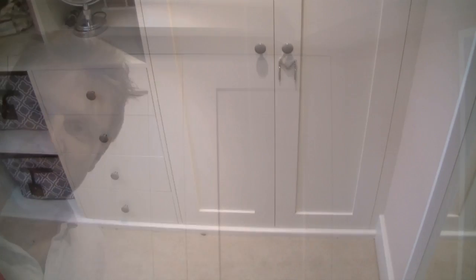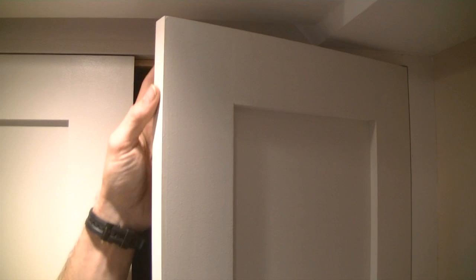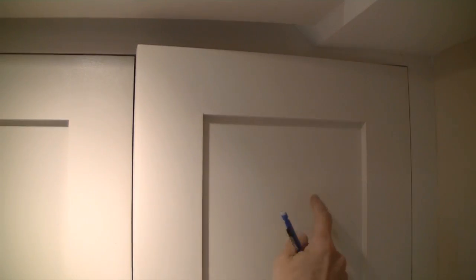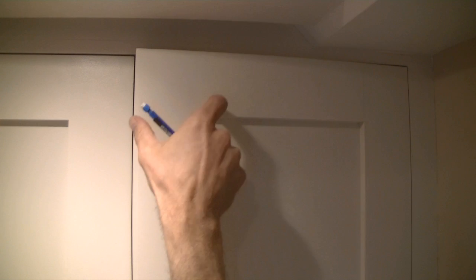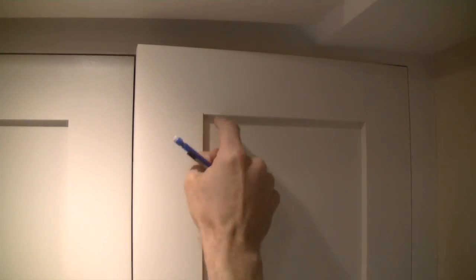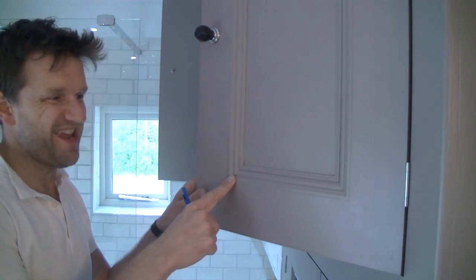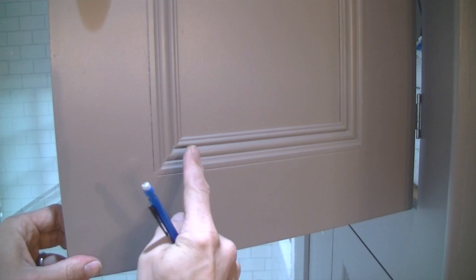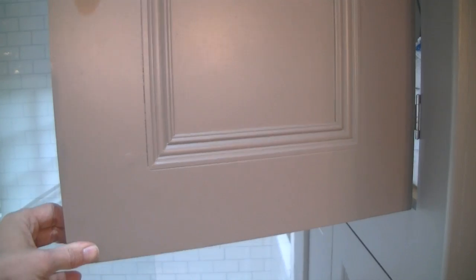Finally, let's take a look at the doors — I've got a great little trick that makes them really easy to make. The doors are constructed from two sheets of 12mm MDF. The rear sheet goes all the way across, and then I've got individual strips — cut by the timber merchants — that go around and form the frame at the front. This way you haven't got any complex routing to make a framework for the door; it's something you can do with any basic DIY woodworking skills. The beauty of this design is that if you want extra detailing you can get mouldings and insert them inside the frame to create a really professional finish.